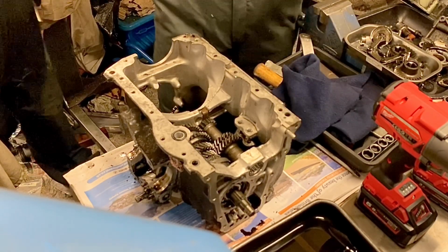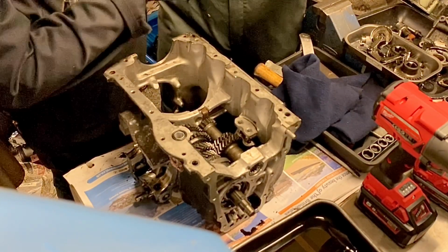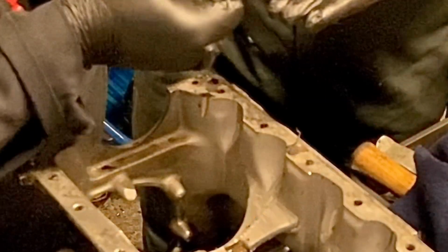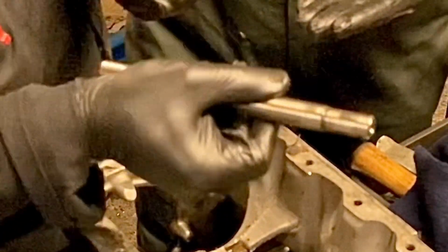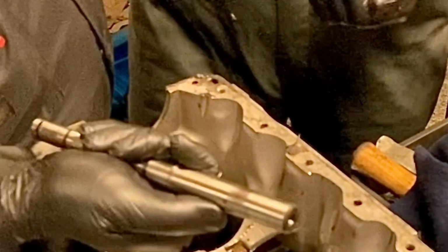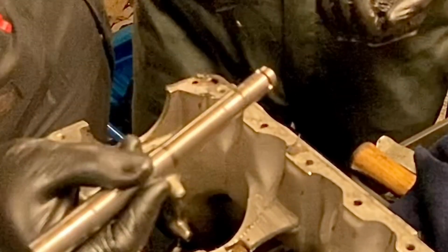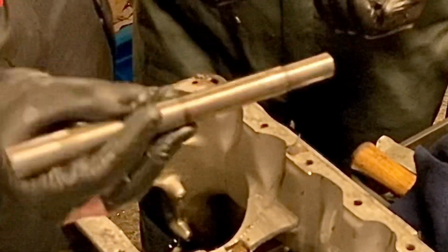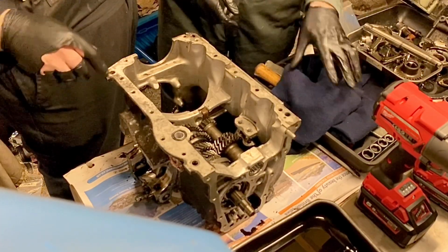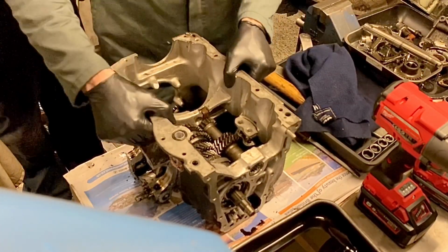Not that we're probably going to reuse this one, but that's the small end where the wear would normally manifest itself. You can see there's quite a witness there. Not too bad, there's no pitting, but it's less of an imprint than that end. Alright, and that's because that end does a lot of work. In the tray.